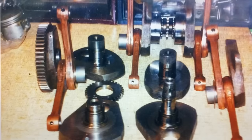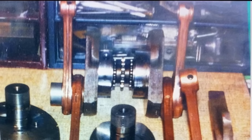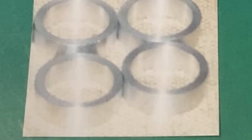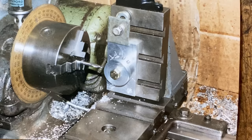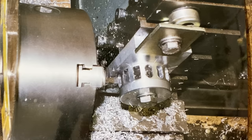And here's all the finished parts for my V8 crankshaft. All I had to do now was make some new big-end roller cages out of 7075 T6 aluminium. I measured an existing big-end cage to get the sizes to make the aluminium cages, just making them a bit narrower. And here's four blanks ready for slotting. I made a little fixture that clamps onto my vertical slide on my old Myford Model Maker's lathe. With this and a little slot drill in the chuck I could then machine the slots, but they had radius ends so I had to make a broach to go in and out to cut the corners out sharp.